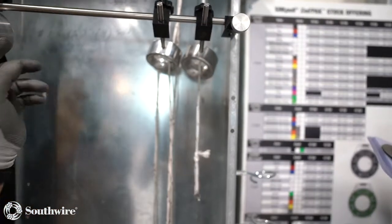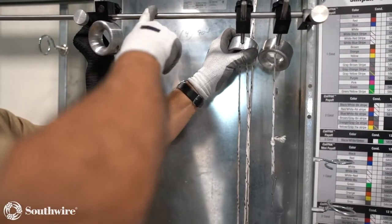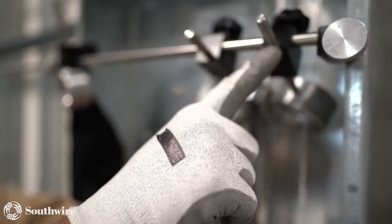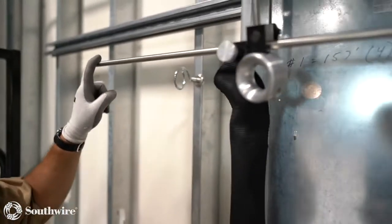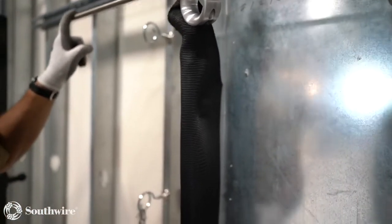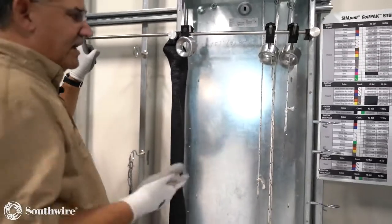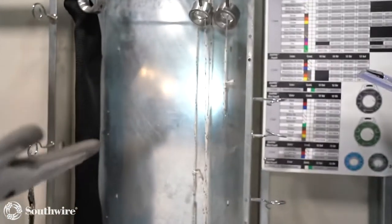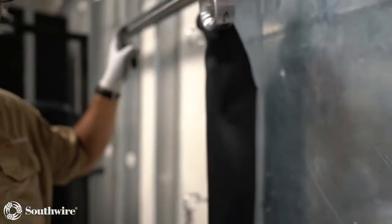We see our Guide-It here. This is our cable Guide-It, and I've actually got 3 on this. This is just a setup we use here at the university to do multiple pulls with 1 bar. But you get the cable guide system, or the Guide-It. It comes with 1 donut. It comes with an extension so you can extend it out for wider panels. You saw the blanket I talked about in our feeder solution. We use these blankets on the circuit solutions too to keep you from getting on the sharp edge of these panels, so now I can use that here. But we have our Grip-It, we have our Guide-It, we have our 1/8 inch rope scenario, and then to round this out, we've now made a tugger for our circuit wire.